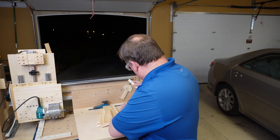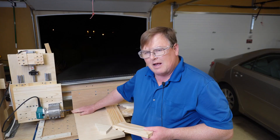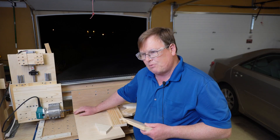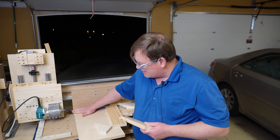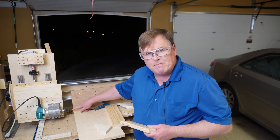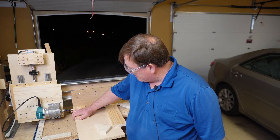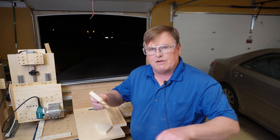You could do an angle cut like a picture frame. Everything is off the same zero, which means everything is always going to align properly because it's off the same reference point. It's not just a one-dimensional reference point — it's actually a three-dimensional reference point because everything is against this flat, this flat, and that. So we've got a three-dimensional locking system to line up, and you don't even have to measure. You can just butt up your board against this face, clamp it down, and run it. Every time, your boards are going to fit together.